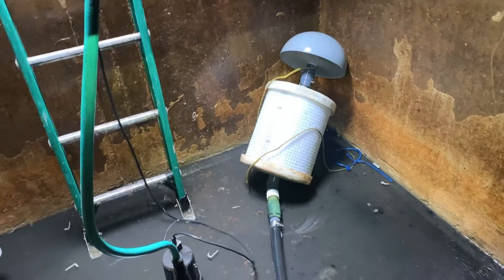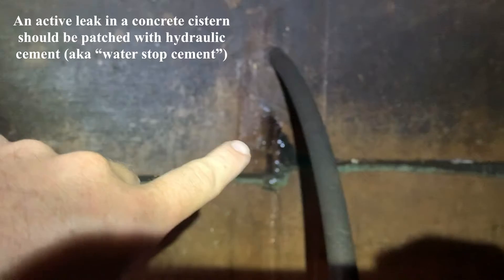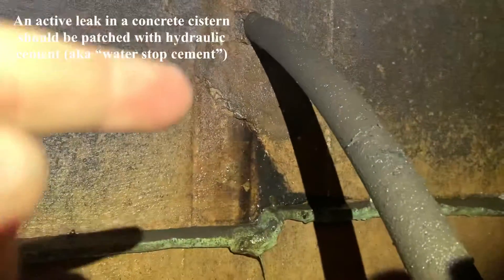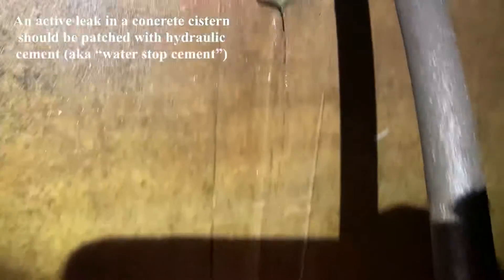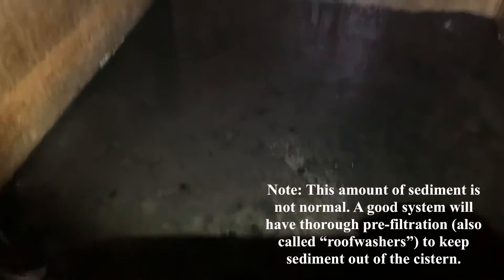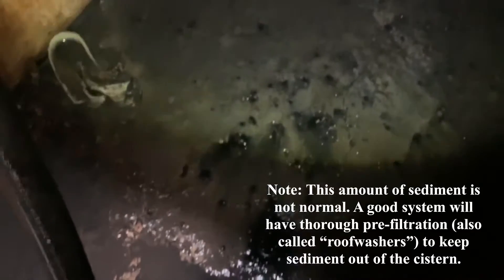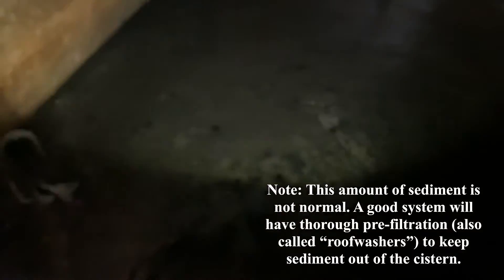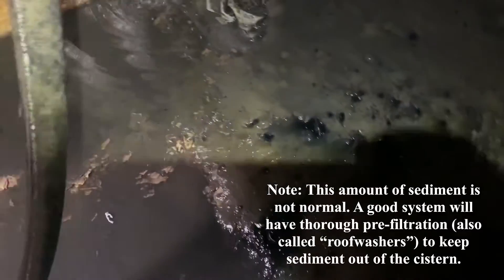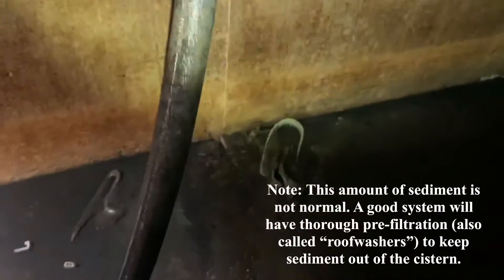After we pump down the tank, we're getting water coming in right here — there's a leak where this water line was sealed, allowing groundwater to get in. That needs to be sealed back up because it's allowing groundwater contamination into the tank. Also, there's a substantial amount of silt in this tank — clearly those pre-filter boxes are not doing their job and need improvement. It's at least four inches thick, a very good-sized pile of silt that needs to be removed and remedied so it doesn't build up like that again.